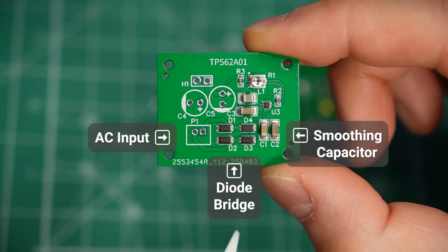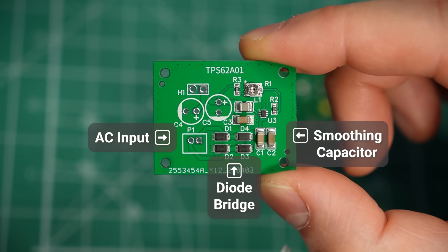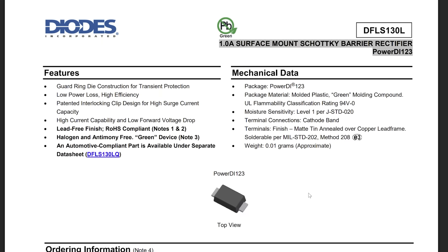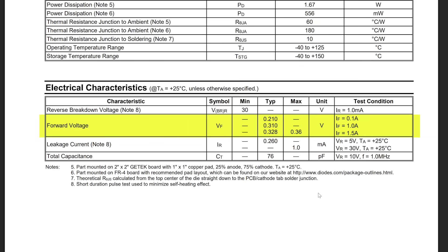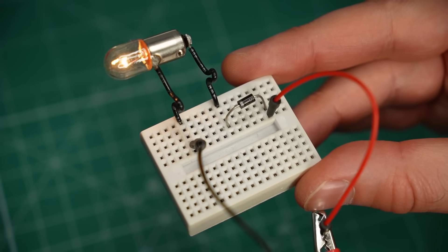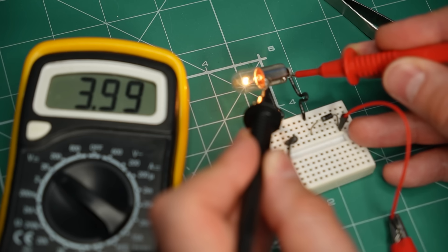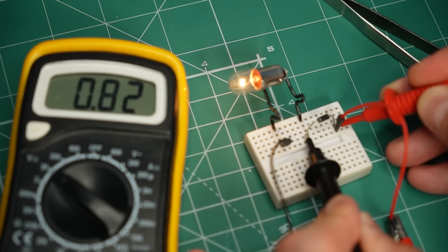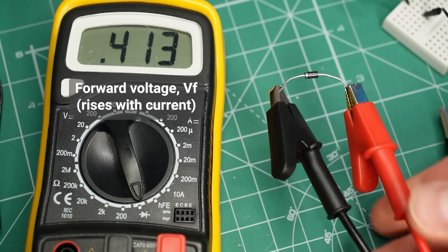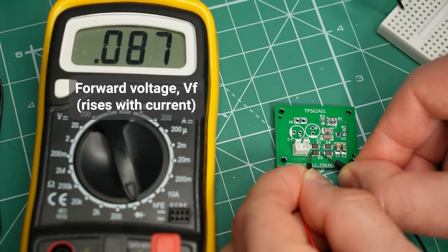Now let's find out how well my design works. The first stage is a full-wave bridge rectifier — a circuit made of 4 diodes that turn AC into DC. But I didn't use regular diodes; I used Schottky diodes instead because they are more efficient. Here I have a load in series with a silicon diode. The power supply is providing 5V, but the load sees only about 4V — the rest is dropped across the diode. The higher the voltage drop, the more energy is lost in the diode as it conducts. The voltage drop for these Schottky diodes is significantly lower, which makes the circuit more efficient.